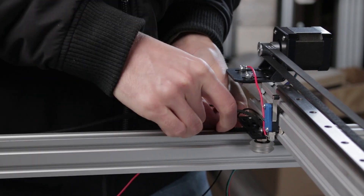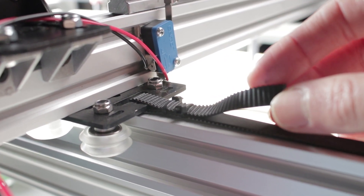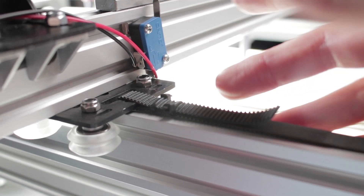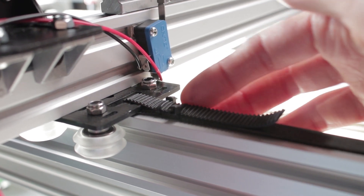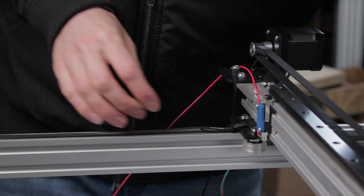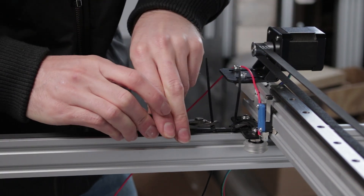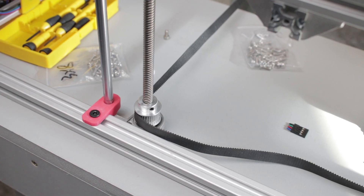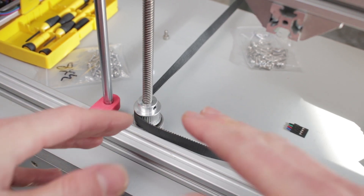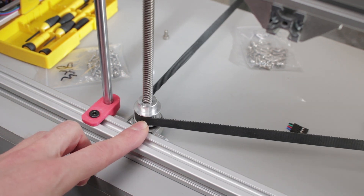I want to thank everyone for the comments last week — I'm going to take another look at my belt looping situation on the Y-axis. On my past laser cutters I've always looped the belt the other way with the teeth facing into each other, but while that grips nicely it makes the belt lift away from the rail slightly because it's going over and then under, which can make it get stuck a little sooner at the limits of its travel. So I was trying it flipped around, but I've decided to go back to the normal way because it didn't really benefit much and I lost the teeth gripping function — but hey, you gotta try these things. Also, as for a decision on manual vs powered Z-axis — drum roll please — we're going to do both. I need to order more parts for powering it, so in the meantime we'll go old school so we can see the two options in action.